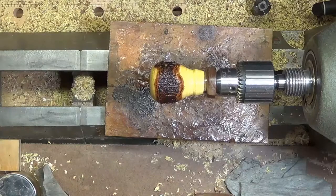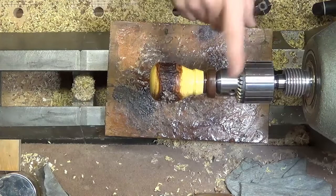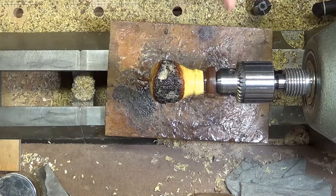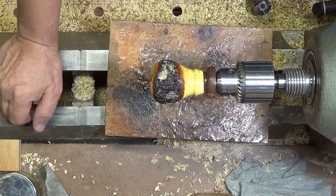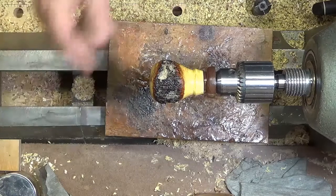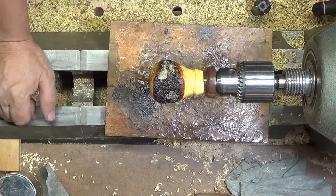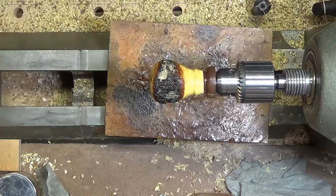Here's my finished bottle stopper, and it looks just as good as the ones I do on the other mandrel. One of the things I really like about doing it this way is that these mandrels you can buy online, but every one I found is made for a 3/8 SAE threaded stud — I can't find them for 8mm. Now I can make my own, and if there are any other oddball sizes I can make my own. They're very easily interchangeable, and the cost on the pre-made ones is very cheap, from $5 to $10.